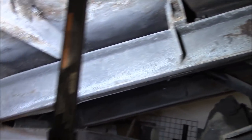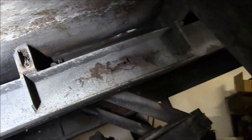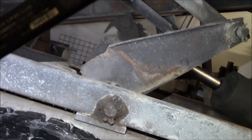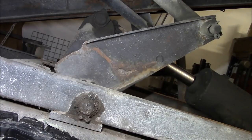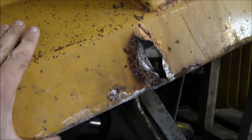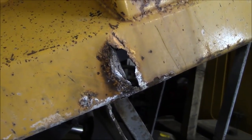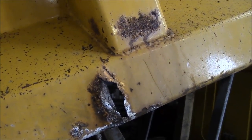So we've got to fix it. My game plan is to take the whole outside reinforcement off — just cut it clear off and see what's left of the frame rail behind it. The hoist arms also have a couple of rust holes in the bottom. For the outside rust holes we'll knock the rust out and plate it. Same with the through-hole here — we'll knock everything off and put a patch over the outside. There's not a whole lot else we can do. It's not a collector car — this is an industrial machine, so there are no style points. It's just got to be functional.